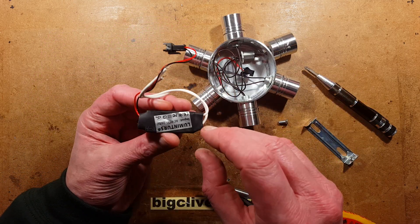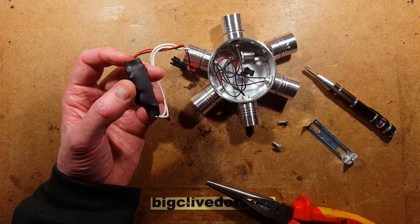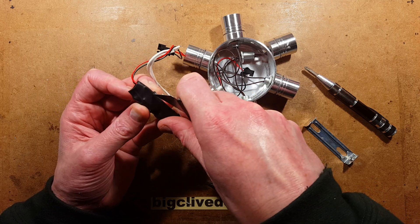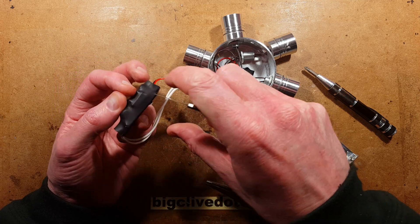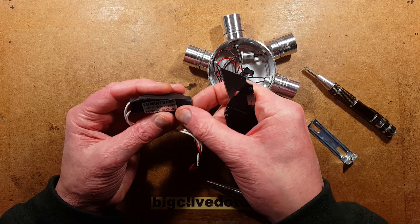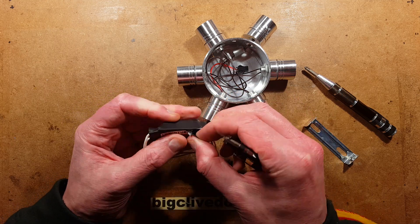Let's take a look at the power supply - that's going to be interesting. Let's get some scissors in here... let's find a sharp knife and slit very carefully alongside the circuit board. The advantage of using this little power supply is that it's straightforward to get a replacement. It doesn't say the output current, but you know the output voltage will be roughly 3 volts per LED - there are 6 LEDs, so that's about 18 volts. Usually these power supplies are rated for about 6 watts and have a range they'll cover.